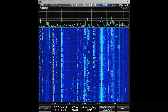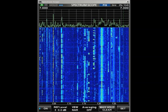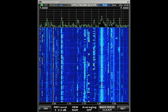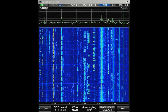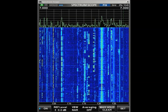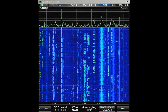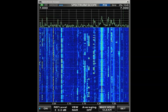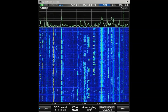This is W6FCC. We're going to go through a couple of quick tuning methods here on 40 meters. I've let this scope run a while — it's running at the slowest possible speed. I have the preamp off on the radio and the RF gain all the way up. This station I'm working through is in Indiana, from California.